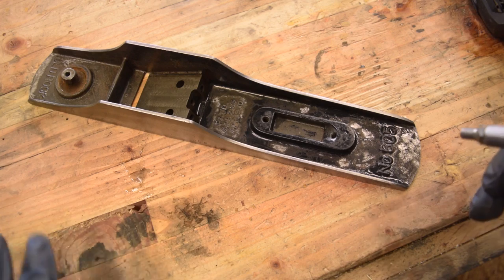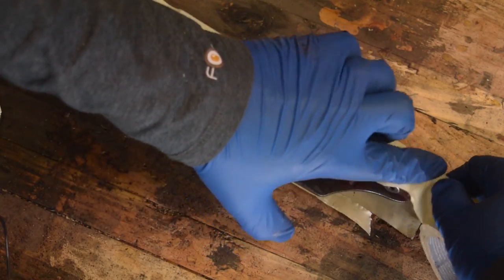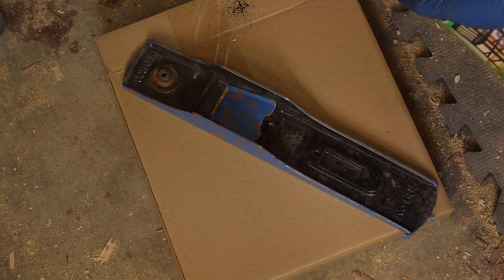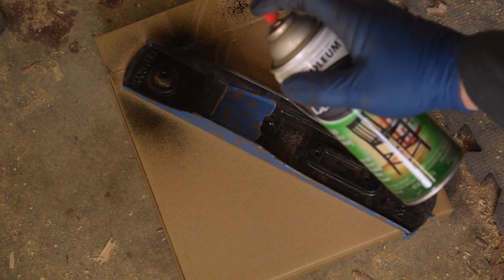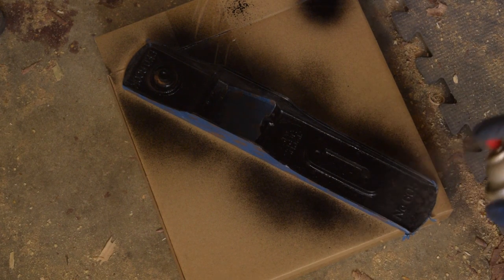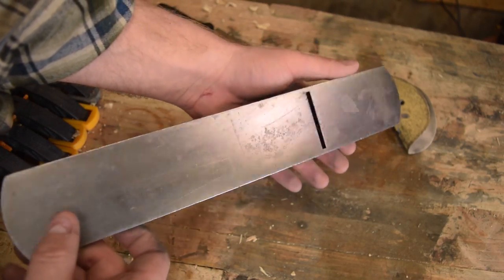Some of the spots were essentially down to bare metal, so I didn't want that to rust any further. I'm going to go ahead and put another coat of paint on this. Before you spray anything, make sure you tape off any of the mating surfaces. I like to spray lacquer on these because originally Japaning was invented by Europeans to copy the Japanese lacquering technique — and spray lacquer is a lot quicker and almost as durable. It won't last a hundred years like a good Japaning will, but if you slowly build up the coats you get a nice thick covering that looks almost original.